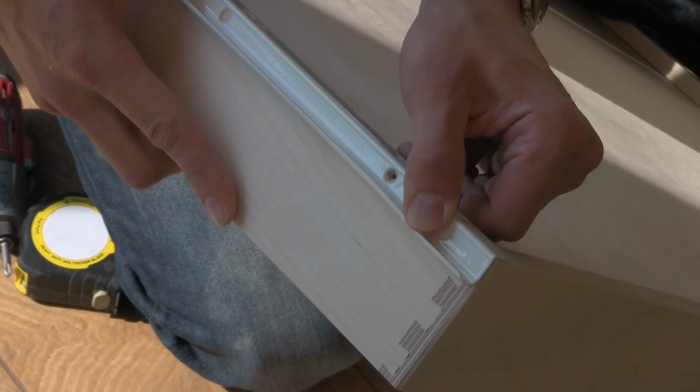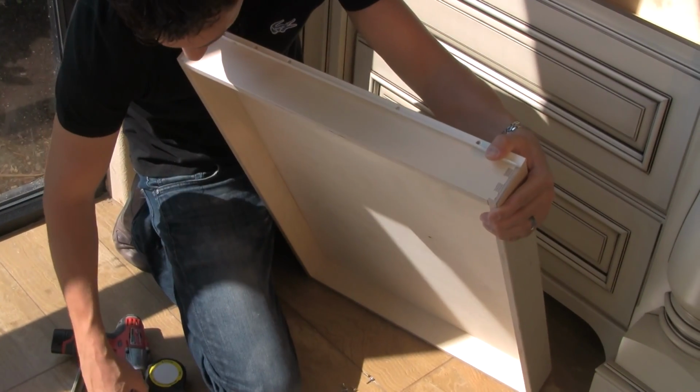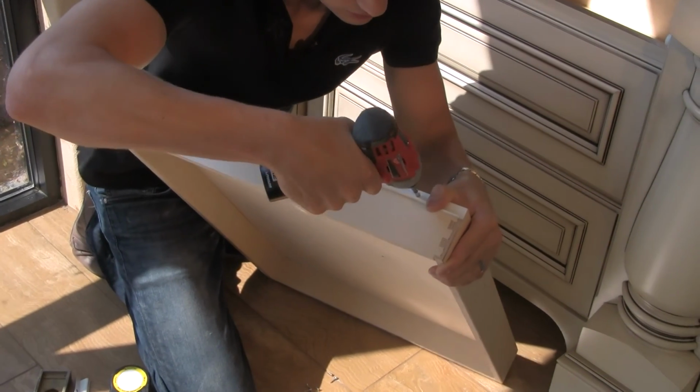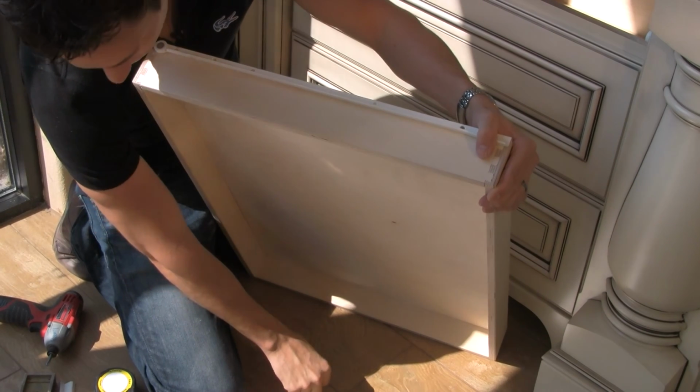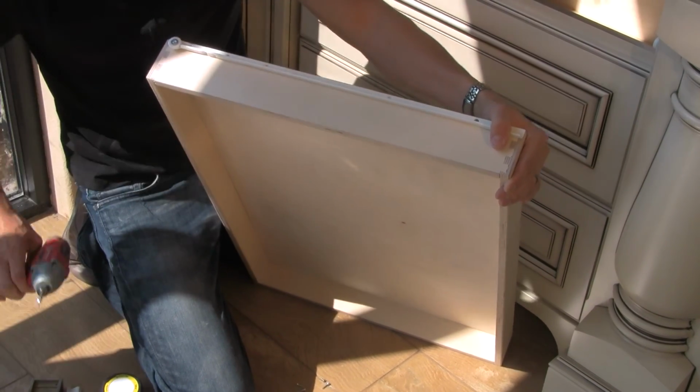And if you split the plywood, it's actually going to enlarge the width of your drawer box slightly. Okay? So, if you're not going to pre-drill, then I highly recommend using a 3/4 wood screw and basically going right in through the side. Real simple. Do another one. You really only need 2 pieces here. And you do it right there.